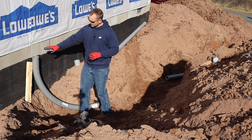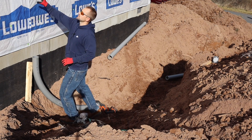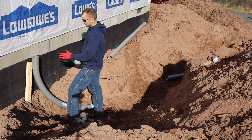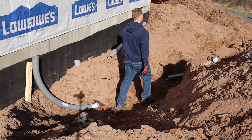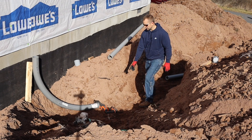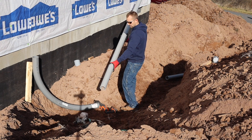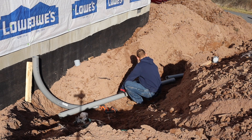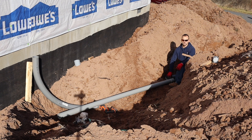Now I'm at the point where the next piece of pipe is going to hit the house. I have a long sweep elbow temporarily sitting here — it's going up to where the meter is going to sit. This will be ground level right there. I have it spaced out from the house where it needs to be, with a mark right to where it's going to intersect the meter. I just lay the new conduit right where it's going to be, with the bell overlapping three to four inches.